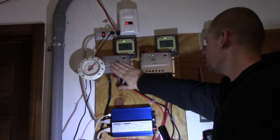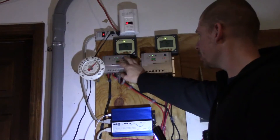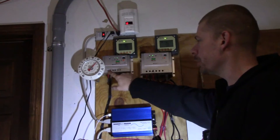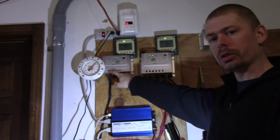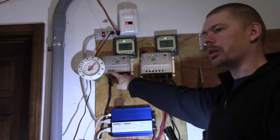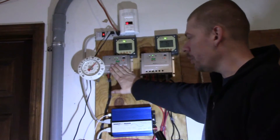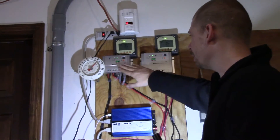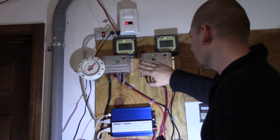This is a new one that I bought, and I noticed that it quit charging when there was voltage coming in at one point. What I did was turn the power off to the solar panels — I've got a disconnect outside that allows me to shut it off — I turned it off and turned it back on and it started working again. I wouldn't say these are the best quality or the worst.